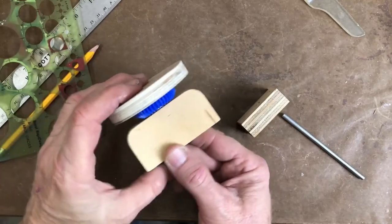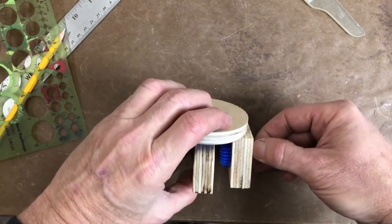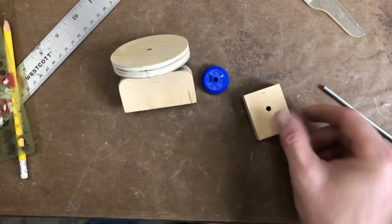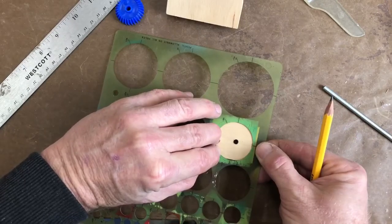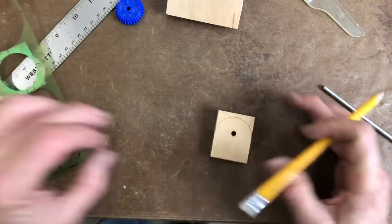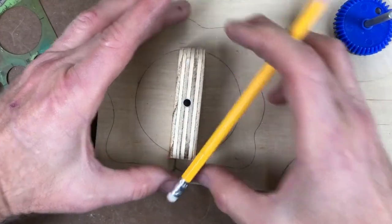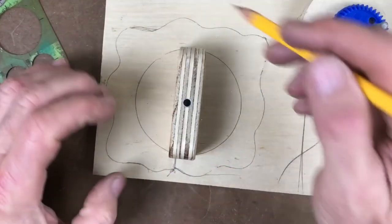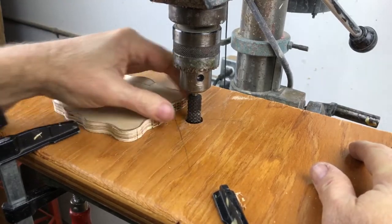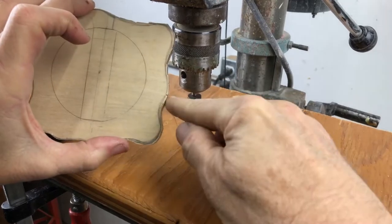This assembly is completed but the next thing is the gear that meshes to it. It fits pretty well in there, so I'm going to round over this shape next. I used the disc sander to kind of coax it into fitting. I'm going to use my circle template to mark out an arch at the top of this little block because I want it rounded over at the top. This is a rotary burr — I set my drill press up to the highest speed and it does a nice job of shaping, especially interior curved stuff like that.